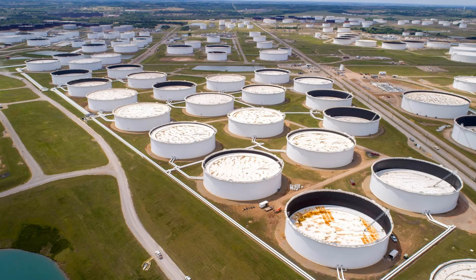Chemicals can be severely corrosive to above ground metal storage tanks, resulting in possible leaks. The average corrosion rate of some carbon steel storage tanks in certain services at ambient temperatures is more than one mil per year, with leaks developing in as few as five years. These leaks result in costs for both tank repair and possible environmental penalties.